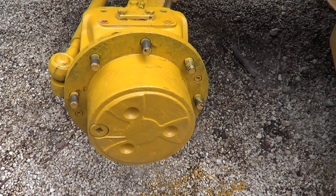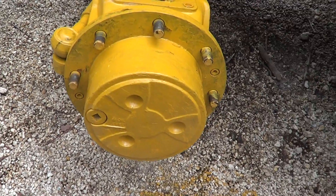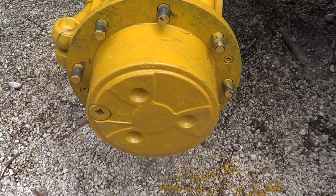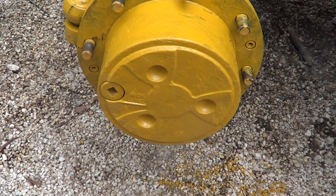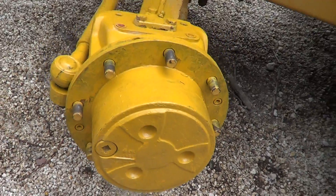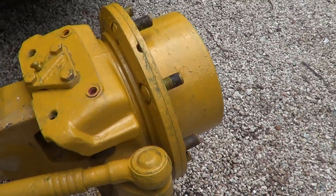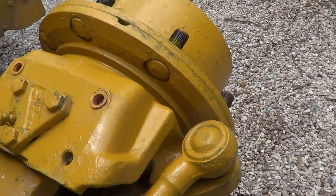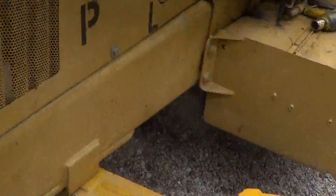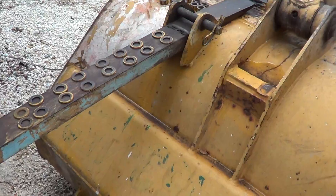Today is 5/20/2013. What I did here was I power washed all of this planetary gear housing, changed the 90-weight oil in the planetary gear housing, and put two coats of paint. I greased everything and power washed front, back, sides, and on both sides of the machine.